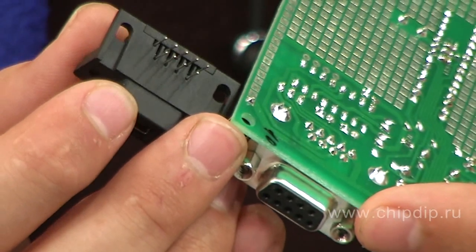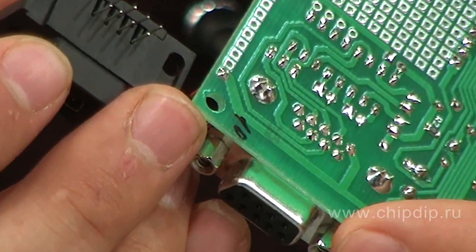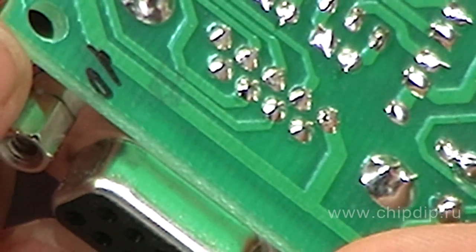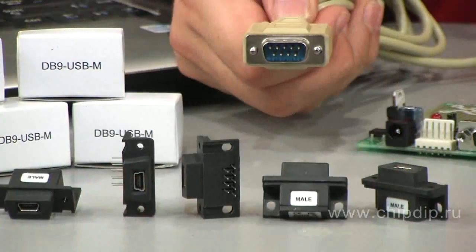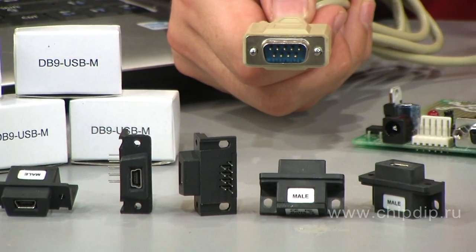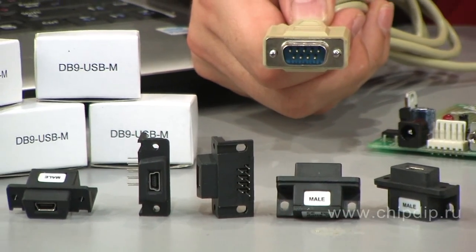The main point is that the device with a DB9 RS-232 slot does not need any modification. It is enough to substitute the appropriate DB9USB model for the D-type slot: a DB9 plug is substituted with the DB9USB-M plug, and a socket with the DB9USB-F socket.